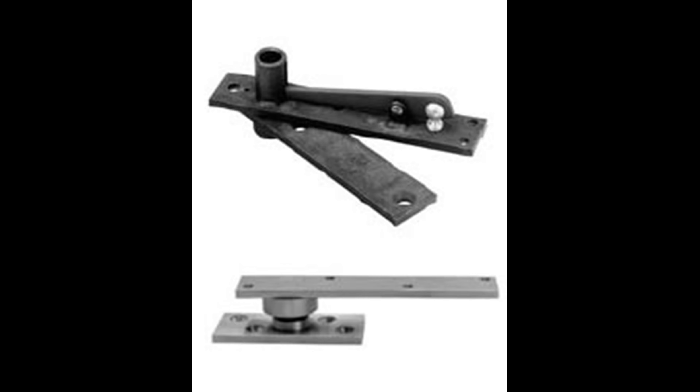370s are not made in three-quarter or inch-and-a-half offset. It's like saying I need a square or round object — the two don't belong together. 370s are center-hung. Other pivots are offsets. It's the offsets that are three-quarter or inch-and-a-half. What's going to be the degree of opening?